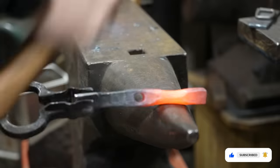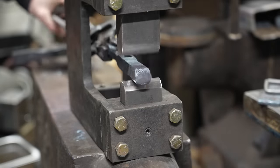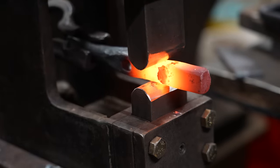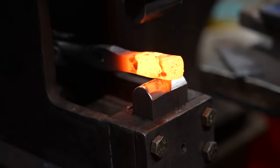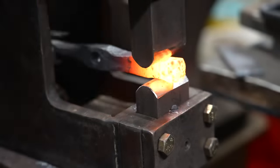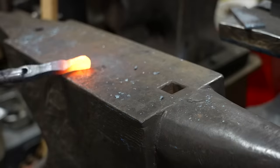I recently got some new hammers from my friend Chris Cash at Mount Phillip Metalworks — they're really beautiful and great to use, so go check out his page. I'm using my guillotine tool here to isolate parts and make basically the jaws of the vise. My friend Cliff Dufton designed this version, and it's a really controlled way to isolate parts of your forging using half-round dies on one-inch bar stock, giving you basically identical and mirrored forgings and saving a lot of time.